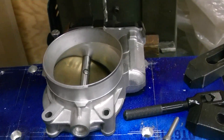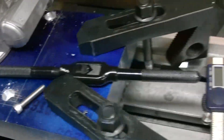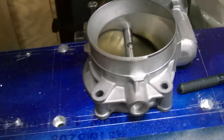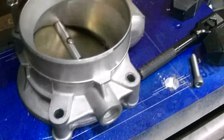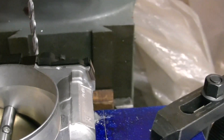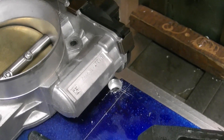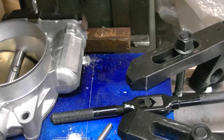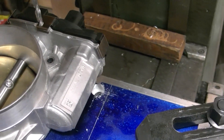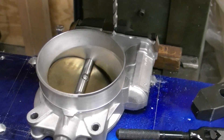I calculated all my measurements out on a piece of paper. I found all the measurements on the top of the blower and then I've been doing my own calculations for the throttle body and measured up all my spacing. After every time I drill and tap a hole, I set the throttle body on and bring the quill of my mill down so I can make sure I'm on the right track. I've been known on my projects to be off ten thousandths or a hundred thousandths and get my numbers messed up, so I'm being extra careful on this one. I've almost got every hole drilled and tapped, and then I can cut this thing out and start milling the bottom side and drill my butterfly holes out. Each time I drill the hole I immediately tap it — I start power tapping and then finish hand tapping it, so I know it's straight and where it needs to be. So far everything is turning out perfect.